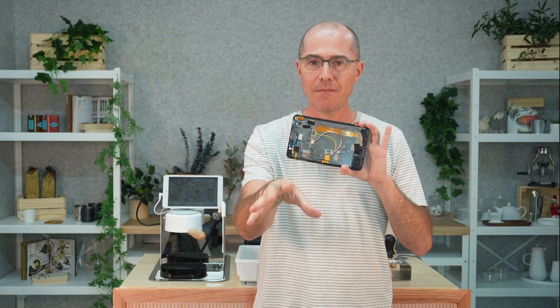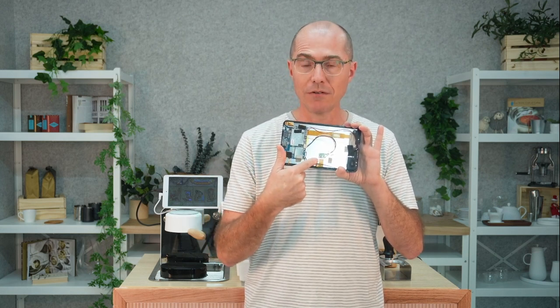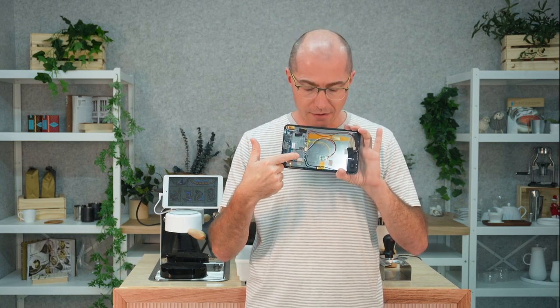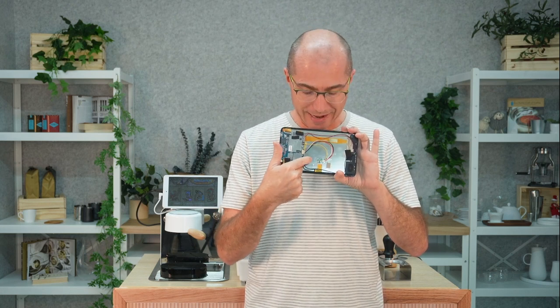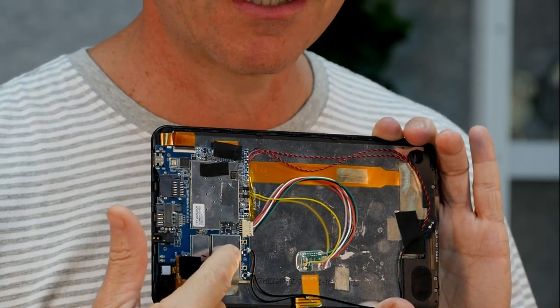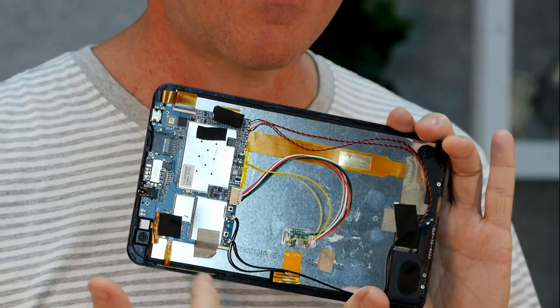That is the reason why you can't directly connect the USB power to the battery — the tablet has a charge circuit that's pulsing, checking how much charge is there, then charging again. This little PC board has a capacitor in it that holds the charge and essentially fakes a battery. Power goes into the PC board, it holds it, and when the power is cut off, the capacitor discharges as if a battery were there at 100%. The tablet thinks it has a battery at 100%. This PC board takes the 5 volts that comes in on the yellow cable and outputs 4.2 volts — which is what a battery outputs — so the tablet is actually running on 4.2 volts, not 5 volts.